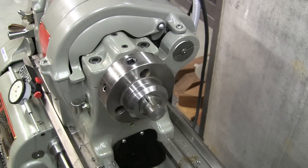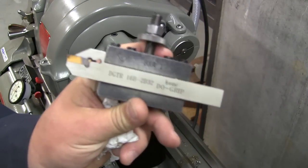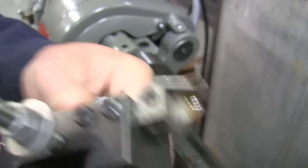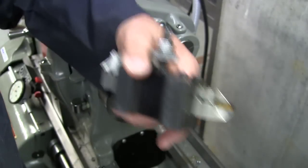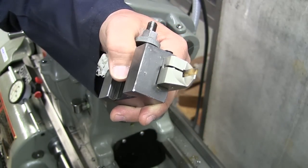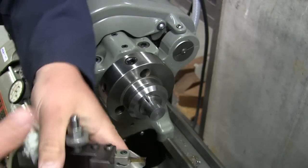So that's carbide. That's my newest carbide tool that I got. I'll let you take a peek. That's this guy right here. So you might want to pause on the part number. But this thing's pretty cool. It does a real good job. It's a 16th of an inch, I believe. It's new. I guess it's what ISCAR just came out with, but their rep brought it down and let me try it out. We experimented with feeds and speeds, and we tried different metals, and it worked out good. So I gave him the business, and I'm really happy with it.